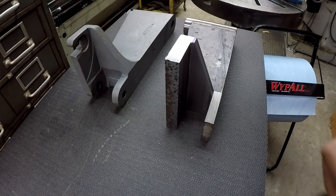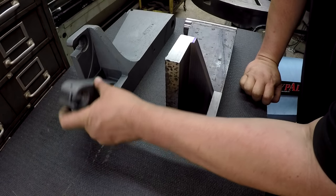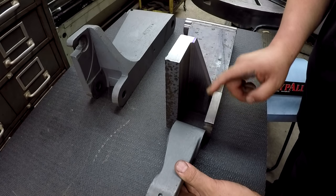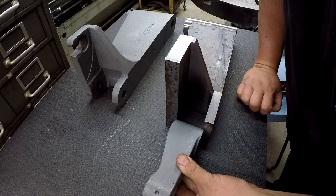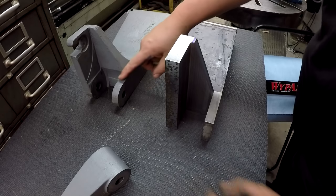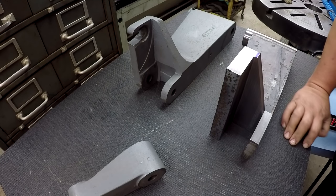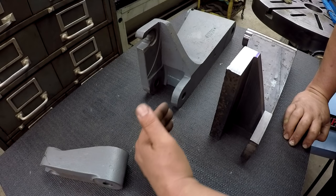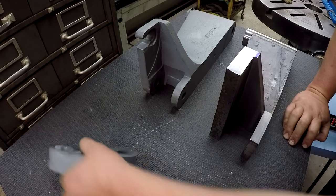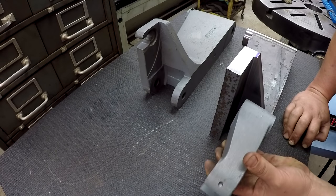I've been posting links to the part that John Saunders is building — it goes right here. This is where it pins on — this is the piece that pivots, it's going to swing in like so. I'll have to do a little bit of milling on this plate for it to fit properly — about an eighth of an inch, just one side. The way K&T actually manufactured this — I'm not going into the extreme they did with all the different cuts. I'm just going to make it work. The way I've got it machined, John is going to build this to the specs I give him, it'll fit and rotate. That's all that matters — it ain't going to bind up.